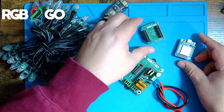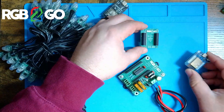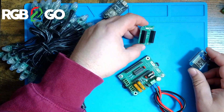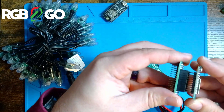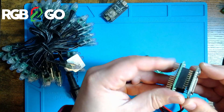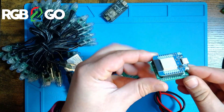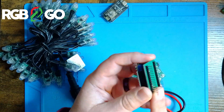The conversion kits you purchase will include both the adapter module and an ESP32, and they will probably already be attached. But just in case they're not, or if you buy them separately, you can go ahead and plug these in. Make sure there are no pins overhanging — just make sure everything makes contact and push it straight in. This is the module, and now we're going to do the same thing with the other side to the board itself.